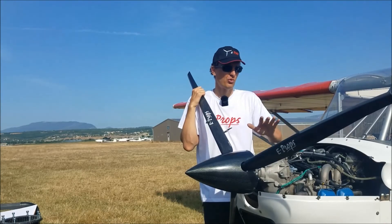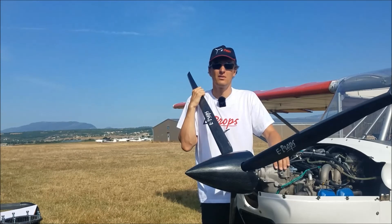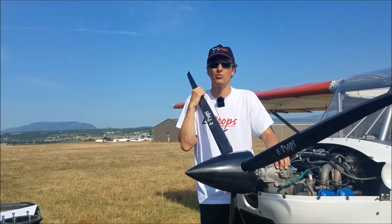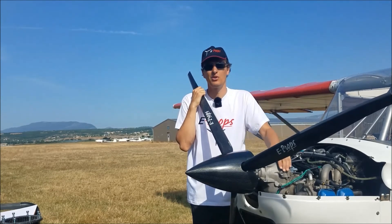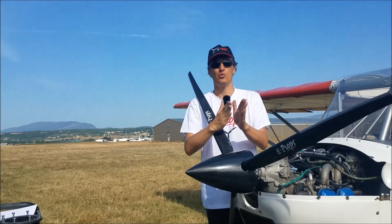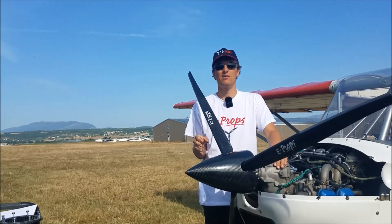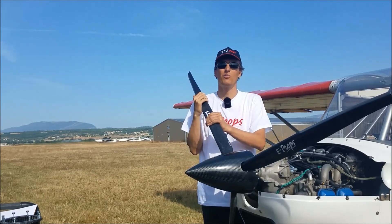Please note that it is important to take the measurement for each aircraft because standards do not really exist in light aviation. On most aircraft there may be small differences, or the aircraft has been assembled as a kit and the covers may have different positions, or various modifications make it impossible to know the spacer length — there always are some exceptions. So, with these two pieces of information — spacer length and spinner diameter — you can directly order from eProps the best propeller for your aircraft, receive it, assemble it, and directly mount it on your aircraft to benefit from eProps performance and lightness.